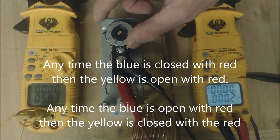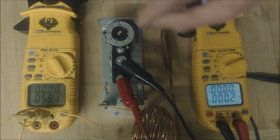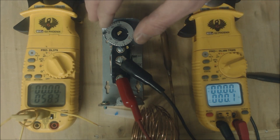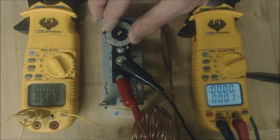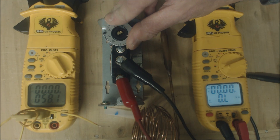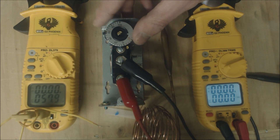There's a little bit of slop with these mechanical ones. That is not the actual switch itself — it's just a plastic piece. You can turn up that temperature swing just by adjusting down here where my thumb is. You see that we have zero ohms of resistance. Let's turn it down from 58 degrees and see when we open back up again — we just opened back up right at about 46 or 47. We'll turn it back up again, and it closes at about 58.